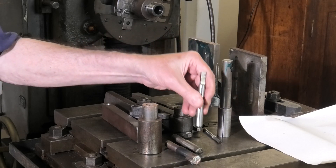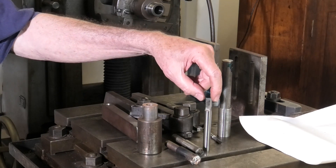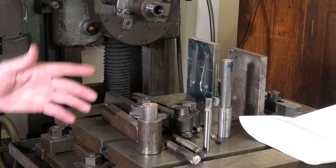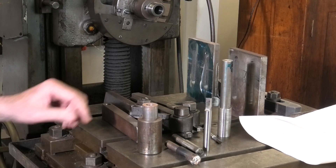Here's a bit of high speed steel I showed last week for doing the 3/8 keyways. Reasonably easy to grind, and it's one tool where an offhand grind will be good enough as long as you measure up the correct width. I usually leave a little bit at the front that you haven't completely cleaned up so that you can grind the end of the tool three or four times without losing the dimension. But you can always side-cut to get the dimension on your keyway.